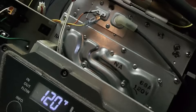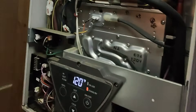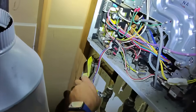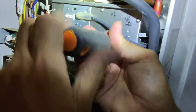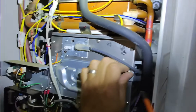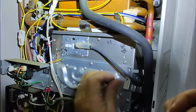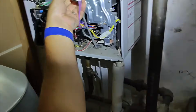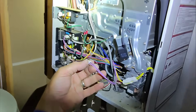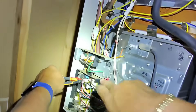There we go. Looks like it's going to be maybe an ignition issue — ignition transformer. Let's close that call for domestic hot water. Let's remove the ignition transformer from the right side of the heat exchanger. There it is. Let's get a volt meter and see if we have voltage here. Two purple wires go into the ignition transformer — it's disconnected here.